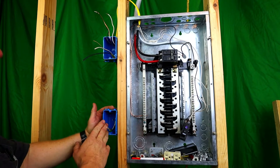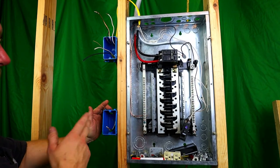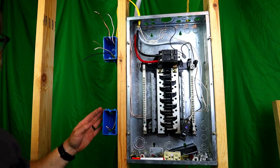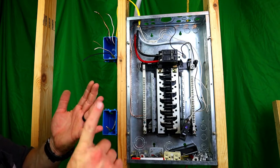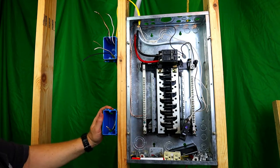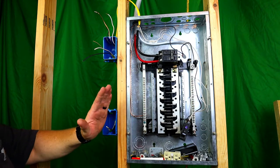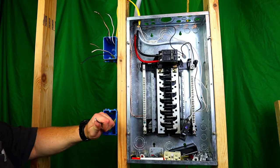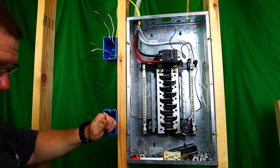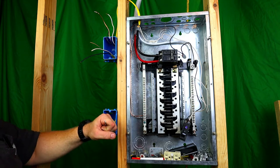The next question is how much wire do you leave hanging out of a box per code. If you were to measure from the back of this box, that's where you measure the length of your wire for your receptacles, your switches, whatever else — you measure six inches out of your box. What I like to do is take my hand, put it up against the box, and cut it right at my thumb. So this is pretty close to where I want to do it — we'll just give it a cut.